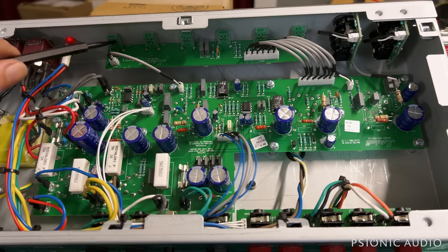It's not anywhere where someone would tend to aim such things. You would typically, with a pair of 34s, want this to be biased closer to, say, 90%, for reasons I don't have time to get into. And people who love Marshall, no matter what's in front of them, will dismiss that anyway. But these 34s are almost marketing tubes. You could have a pair of 6V6s in here, have less expensive tubes, have a similar sound, and achieve the same output as they're doing with this pair of starved EL34s.